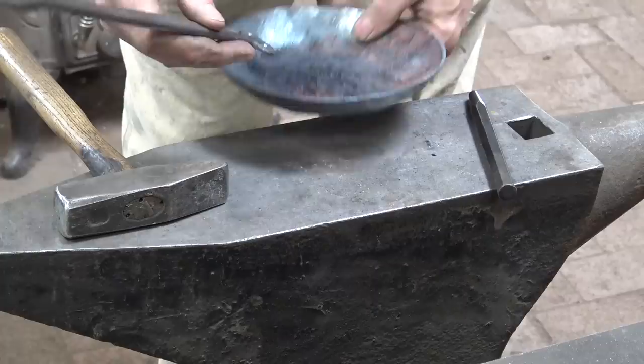Now I'm just going to hand hold this under the drill press, but I know from past experience that I can stop this drill press. The belt slips very easily and I'm not worried about it grabbing and ripping this out of my hand. If you're not that familiar with your equipment, or if you know your equipment is much stronger than you are, find a way to clamp this up or use a hand drill on this. It'll probably be safer. But I'm not worried about it with this drill press. It's one of the little annoying things about it that it does stop so easily.